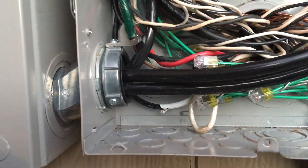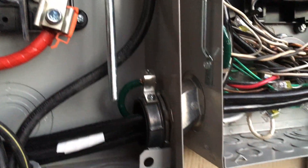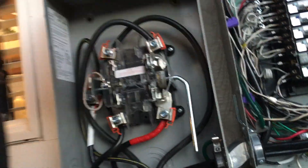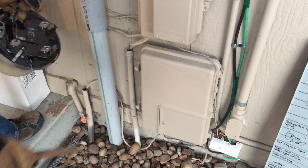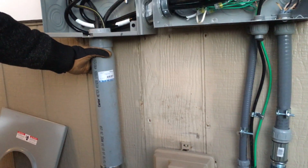Right here is my bond bushing — it has to be a number four on a 200 amp service, and that's in NEC 250-66. My bond bushing and plastic bushing are here, and then we bring in our Deox. We did bring in copper 2-0 on this. There's a table on the back of the code book in the index — I think it's table 7. We had to dig down two feet, get rid of the old GRC conduit, and put in PVC. I have my box adapter at the bottom, a coupling, and I run green stripes so my inspector can see schedule 80 and my two-inch riser pipe.